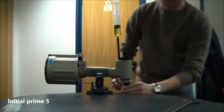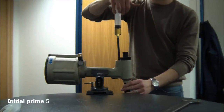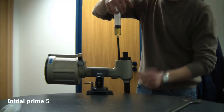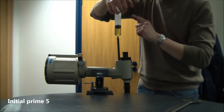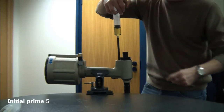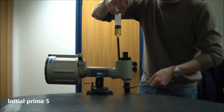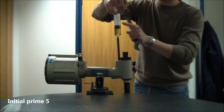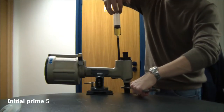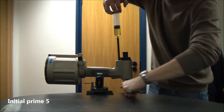You can feel slight resistance now. Before you start winding any more, you've got to maintain pressure on the syringe. It's important to make sure any time you wind the pull stroke setter, there's always pressure on here to ensure positive pressure going into the front of the head piston. Use a 27mm cross-flat spanner and start winding the head piston back — pressure at all times. When you're not winding it doesn't matter, but as soon as you start winding you need to keep pressure on to drive any oil in when required.